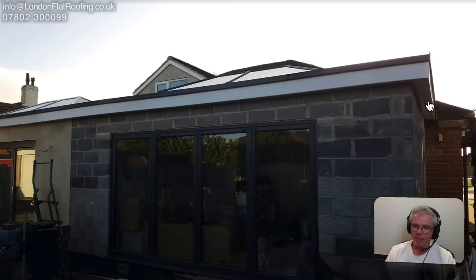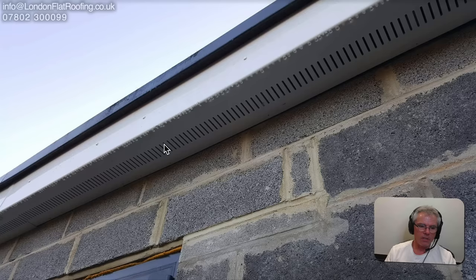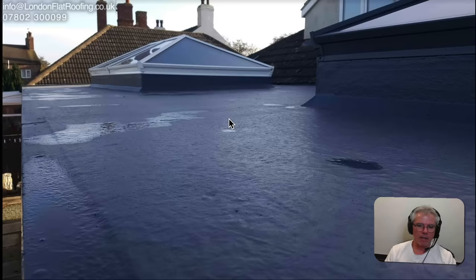On the outside there's some lovely detailing — I can see a vent there and there's a vent going down the side. However, the side vent doesn't actually vent anything because the joist ends are against the wall there. To increase ventilation, if he cuts into the top of that joist furring across, he can make that one vent across and into the space, which will help increase everything. Any increase in ventilation on a cold roof is always going to help. There's a lovely big airflow at the back as well.